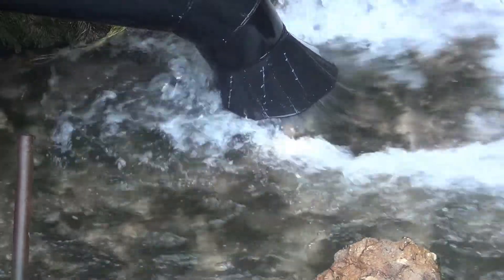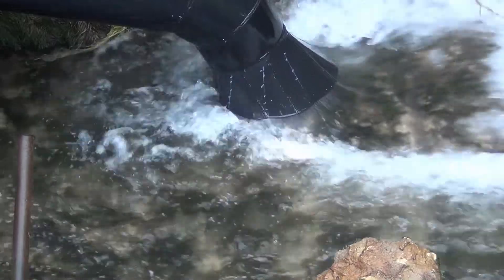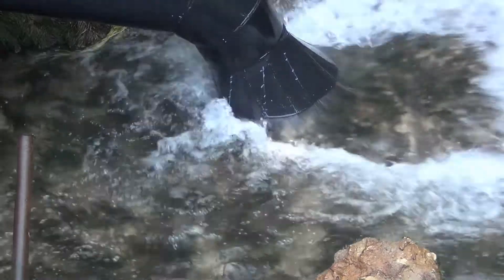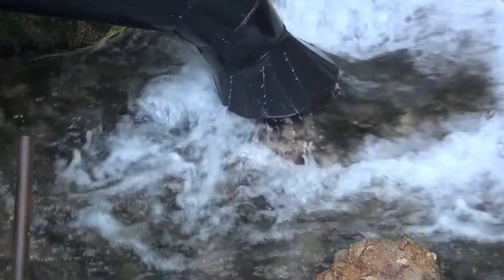The last very important error is the non-immersed draft tube. Look closely at the outlet: if the water stream sticks to the pipe wall, the situation is not that bad. If not, the output power drops drastically and the turbine may even stop working due to air sucking.